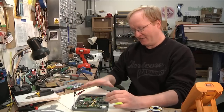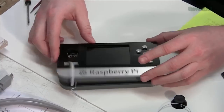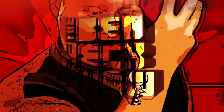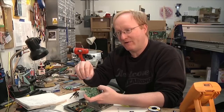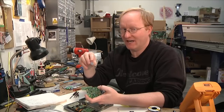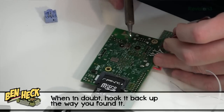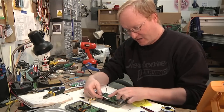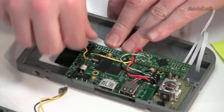I want to make sure the wires fit when I take this apart. Here it is open — as I fold it together, see how the wires get bunched up? You have to have enough room in your design to accommodate for that. I'm going to rewire the headphone jack now. It has four prongs — it probably has a disconnect and a pass-through. I'd better hook it up the way it was originally, otherwise the automatic audio to HDMI or the headphone jack might not work. I'm going to hook up all four wires plus ground and fold them flat so they lay flat.